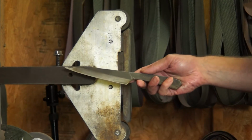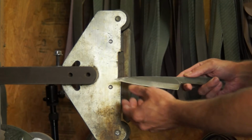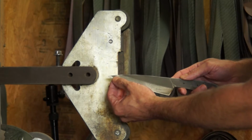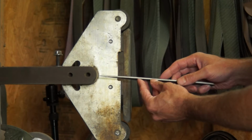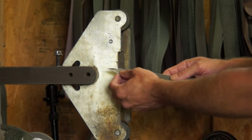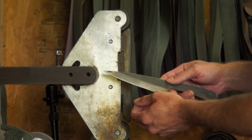I plan on doing it with this little blade, and before we get much further, some of you can probably see that I left meat there. One thing I found on these thin knives, these are 3/32 XHP, is that in heat treat, sometimes the tip can get a little wonky on me, so I just leave it thick. It doesn't take much to grind it off.